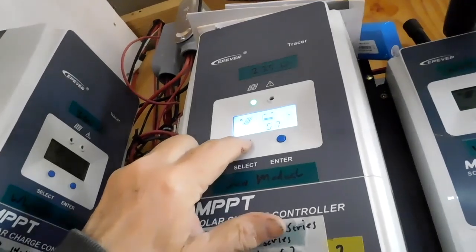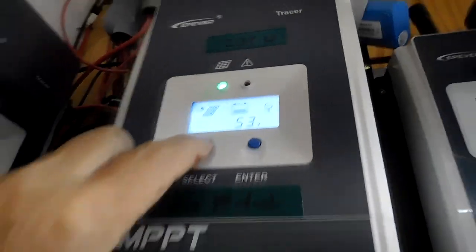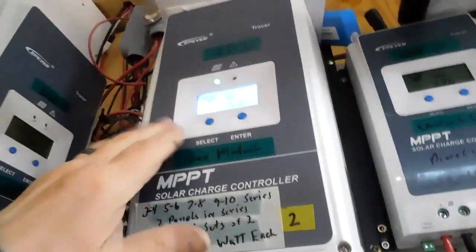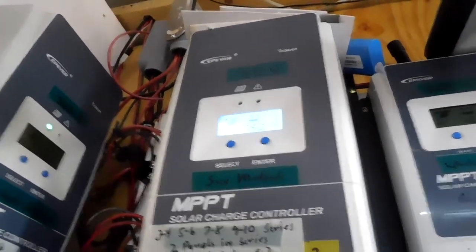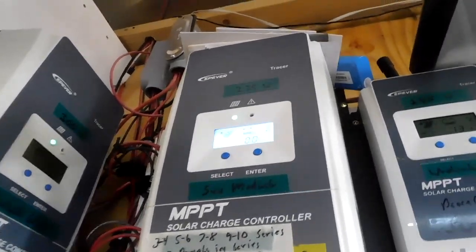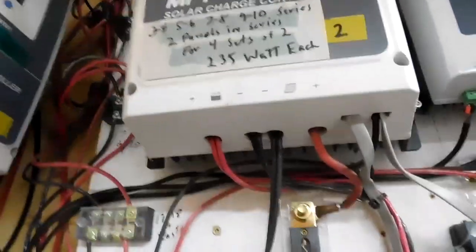So right now, let's get back to the PV. We've got 53 volts. Doubling this should bring it up over 100, which should give it a closer match to the panels that I'm installing in 3s out back. So those out back should put out about 100 set up in 3s, so everything will equalize. I don't know if it's really going to make any difference, but I'm going to give it a try. I think it's a good idea myself. So anyhow, I'll be back.